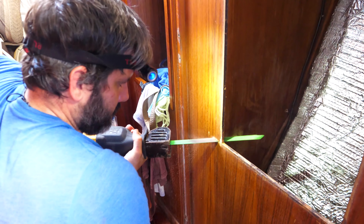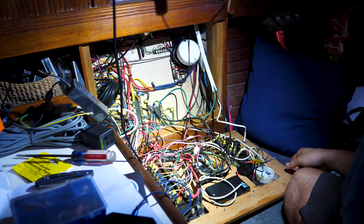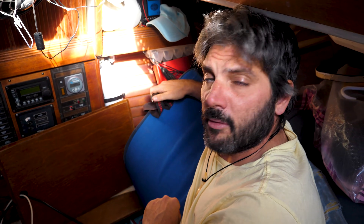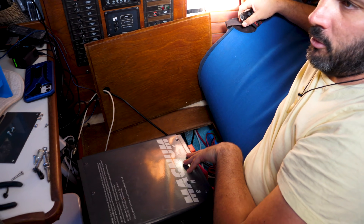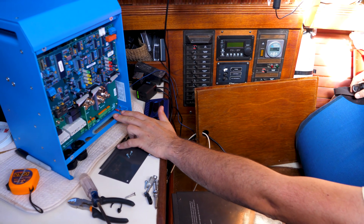We showed you the first part of that process last time, and today we're pushing forward into the bilge. Before we continue though, we're upgrading our inverter charger to a new Victron model. The reason we're swapping out inverters is because this one is old — it was built in 2014. As we're heading to more remote areas, we want to make sure nothing breaks. The Victron unit is bigger — 3000 watts instead of 2000 — and it's pure sine wave instead of modified sine wave. We've been having issues running sensitive electronics on modified sine. Modified sine is basically like dirty electricity, slightly different frequency.